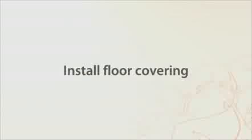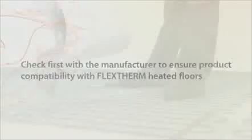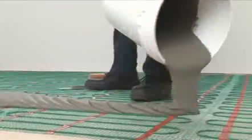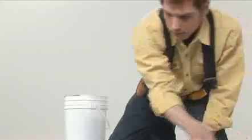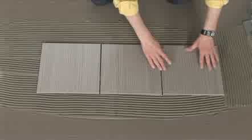You are now ready to install the floor covering. We'll look at two different techniques. Check first with the manufacturer to ensure product compatibility with FlexTherm heated floors. The first technique uses glazing with polymer-based dry-set mortar. Apply it in the same direction as the cables using a flat trowel at an angle of 45 degrees. When it is properly dried, usually after 24 hours, install the floor covering with the recommended adhesive. The glazing stabilizes the cable and helps with installation of the floor covering.